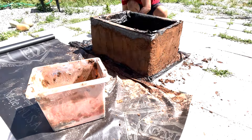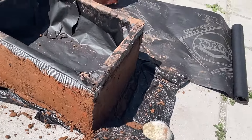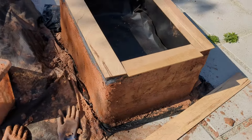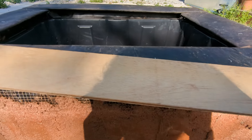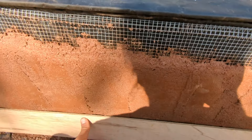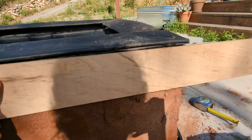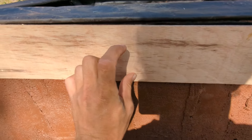I left some room from the top because that is where tile is going to go. Walking around gave me another perspective and I saw how the grid had also imprinted a texture onto the mortar. Then I had to create a lip so that the tile would have a place to sit. This overlaps the basin, and I'm going to use this four-and-a-quarter inch wide board to get an idea of where my tile is going — it's going to overlap the stucco. So now I've got to put mortar behind this, then the tile.